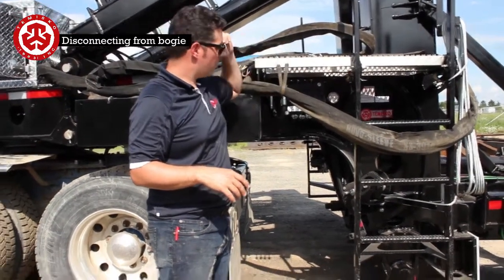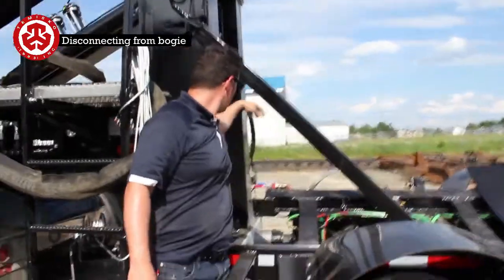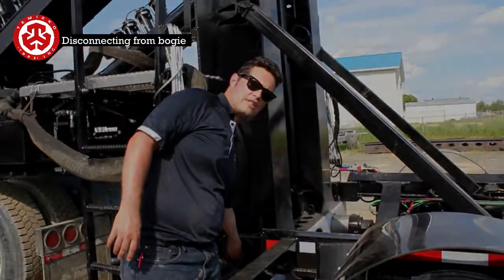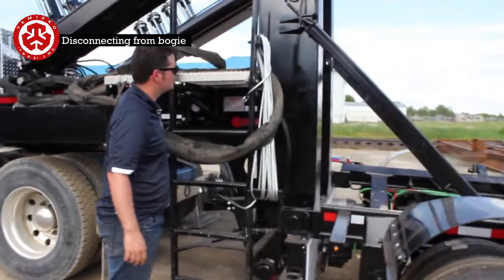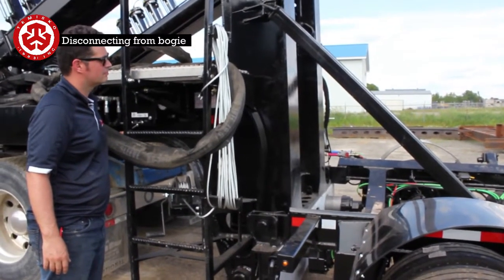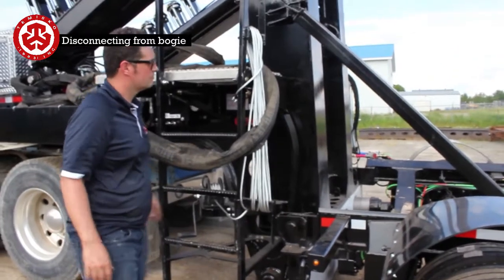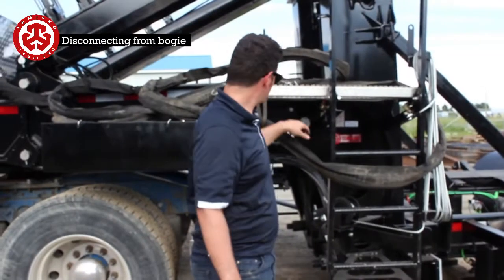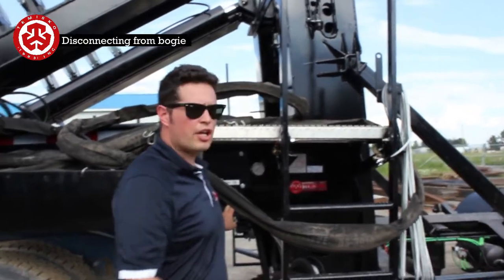So what I'm going to do next is I'm going to lower it until these rods here, I pick up the slack in here. I'm going to store those, and then I'm going to use the stingers. I'm going to make sure to grab the slack in here. I've taken out both pins on the bottom side. I'm going to continue to rotate the gooseneck forward.